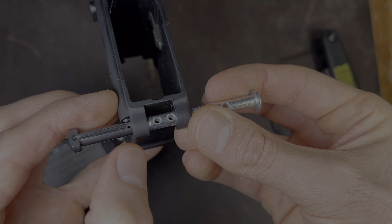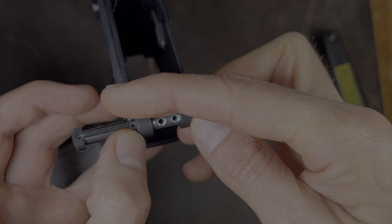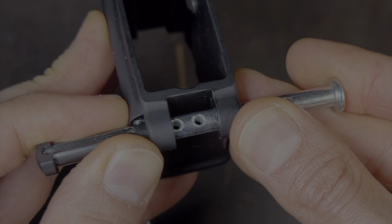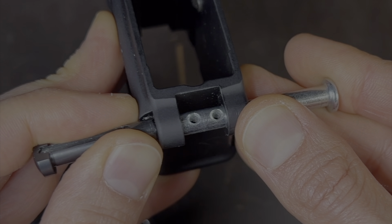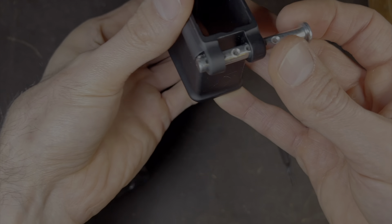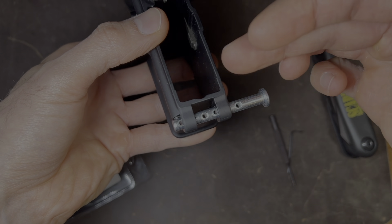So we're going to slowly replace this pin with the clevis pin. You're going to keep pressure onto this pin because the detent and spring are always going to be pushing this way, so we have to push toward that to combat the pressure while pushing the clevis pin in the other direction to replace that pin. I'm going to use my thumb to push this way and then use this hand to slide the clevis pin in, pushing the original pin outward. Now the clevis pin has taken over. The pin is out, and now the detent and the spring are still captured inside the lower — the clevis pin has basically replaced the old pin.